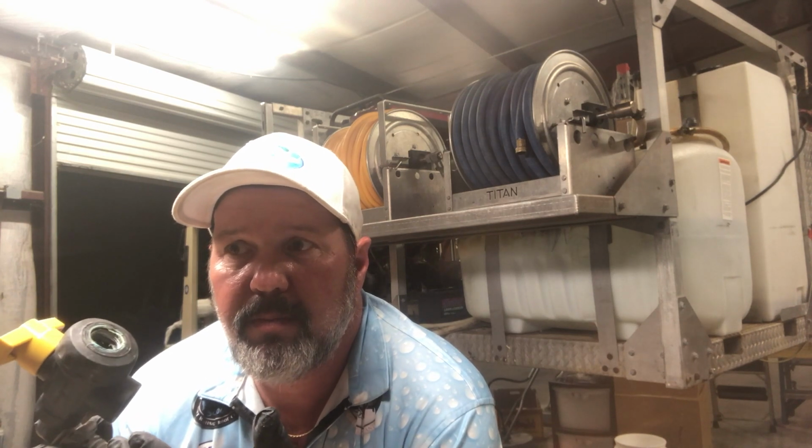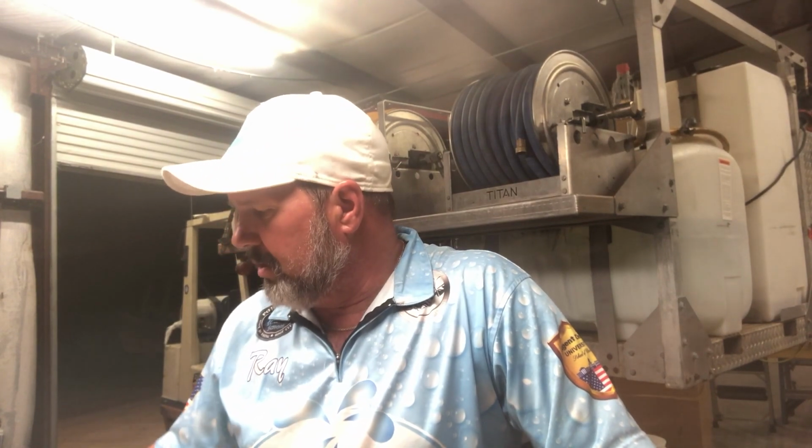So your equipment is disposable. Yes, you want it to last, but nothing lasts forever. You change belts on your pressure washer. You change seal kits in your pumps on a pressure washer. People throw away 12-volt pumps left and right. And I hear people fussing about the booster pumps. Oh, well, they're not reliable, and you have to replace them. Well, you don't have to replace them. You have to clean them, and you have to maintain them, and maybe replace some plates.